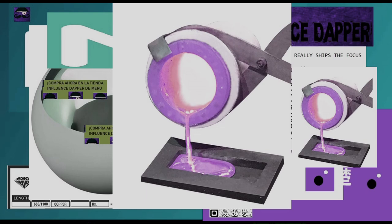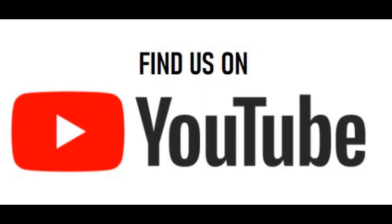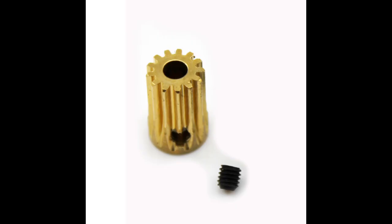While the process you outlined involving the dissolution of aluminum in a complex solution and subsequent precipitation with zinc is a unique approach to aluminum production, it is important to consider the potential purity levels achieved compared to traditional methods. Using scrap aluminum directly in a crucible and furnace for casting is a common practice in metal casting and recycling industries. The purity of the resulting aluminum ingots from this method would largely depend on the quality and composition of the scrap aluminum used. In contrast, the process involving the dissolution of aluminum in a solution with various chemicals introduces additional variables that could impact the purity of the final aluminum product. The presence of impurities in the chemicals or incomplete reactions during the process could affect the overall purity of the aluminum ingots obtained.